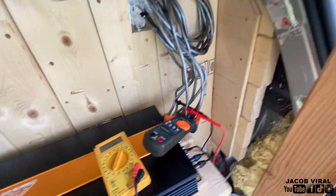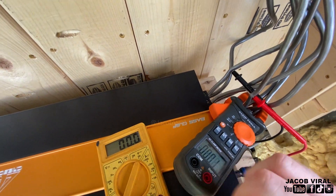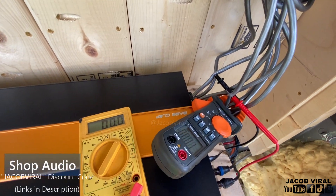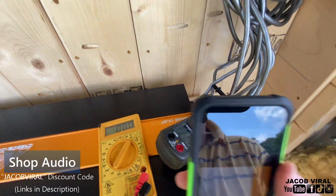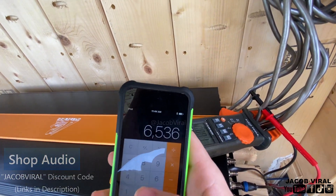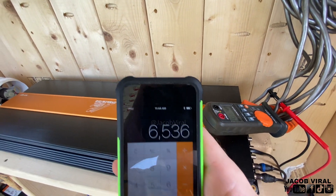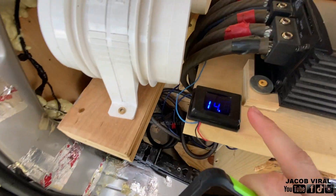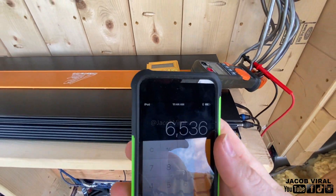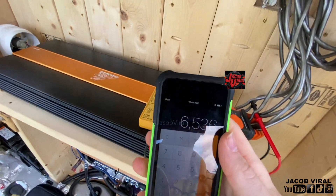That was 76 and 86 — those are the numbers I saw. So 76 times 86 — there you go, that's to clipping. That's right when the amp was starting to turn off. So the 6K amp clamped 6,500 watts at clipping, and voltage dropped to about 12.7 to 12.8 volts. My impedance rise is not very much either, which is a really good thing. That means I'm getting the most power I can out of this amp.